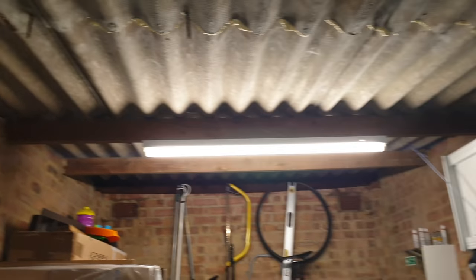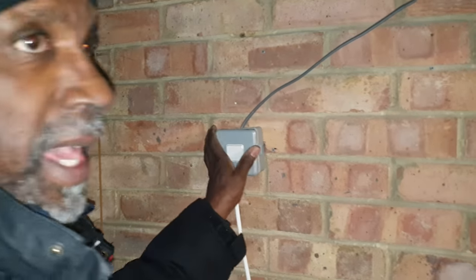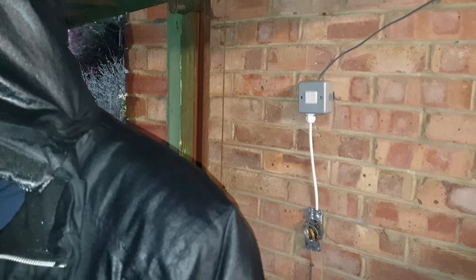What's happened is down there it's an old split board, and when I saw the RCD, I thought it looked funny. I thought it did the circuits, but it doesn't. I think the fuse for that circuit needs to be taken out and put on this side, and then you need a link from the RCD to that fuse, because they've made the RCD side redundant. You could have just put a 15-way fuse board in there nicely with RCBOs, and everything would be protected. It would have been cheaper and much better. Yeah, definitely. But it's unfortunate some people just don't clue you up on these things.